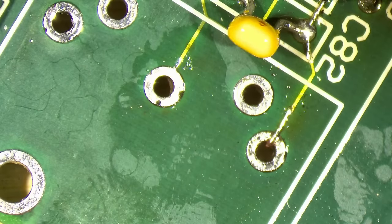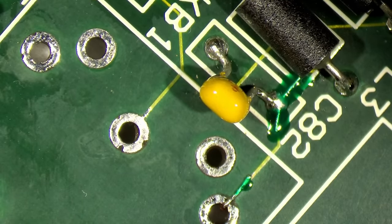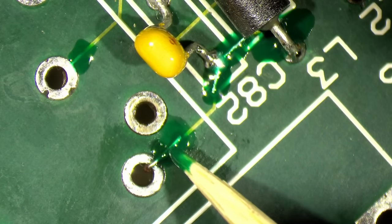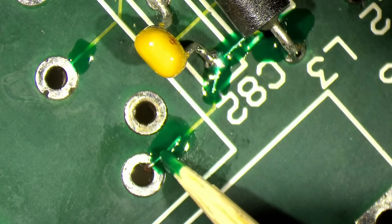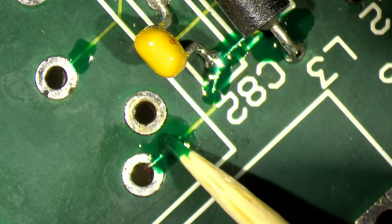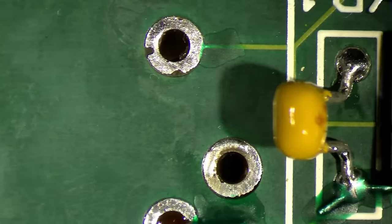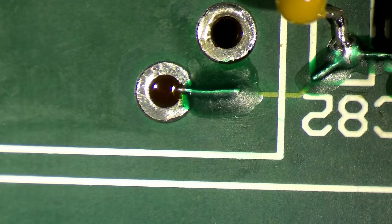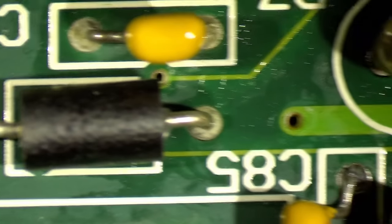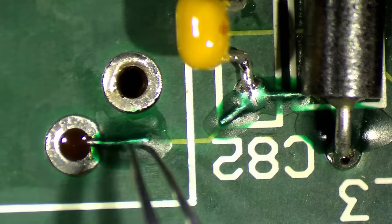Let me clean it and catch the sunlight for the solder mask to cure. Here. There we go. Now it's okay. So, time to go outside. Okay, so the solder mask is cured as it looks like. Surprisingly, there is still some liquid here. This looks all like flux that I didn't catch before, but that's okay. I think the rest is all good. It's also nicely hardened here. And all of these parts should not move now anymore.